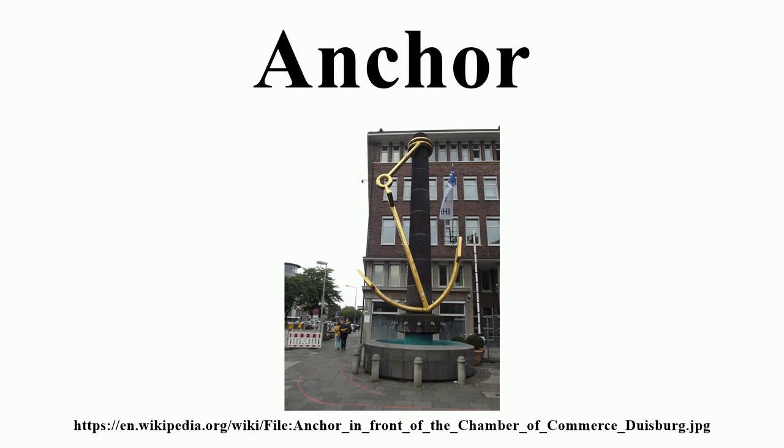While there are numerous variations, stockless anchors consist of a set of heavy flukes connected by a pivot or ball and socket joint to a shank. Cast into the crown of the anchor is a set of tripping palms — projections that drag on the bottom, forcing the main flukes to dig in.